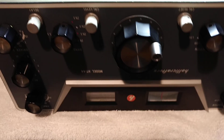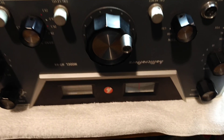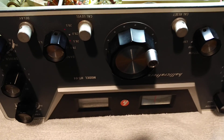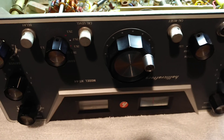Because of the way that this HT44 is heterodyned, a higher VFO frequency means a lower RF carrier output frequency on the bands — 80 through 10 meters. And the lower frequency is what you want for space for a normal FSK polarity. So it's functioning just fine.